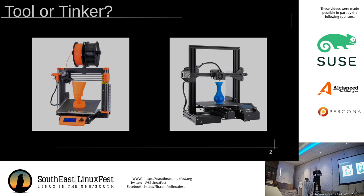At some point fairly recently, PETG came on the scene, and it is kind of in between PLA and ABS. It's still easy to print like PLA, but it has higher temperature limits and doesn't have the fume problem that ABS has. The problem with PETG is that it's dual mode. If you print it with your cooling fan on, you'll get fantastic bridging performance — when you have filament going unsupported between two points — but you will have terrible layer adhesion. If you print with the fan off, you will have terrible bridging performance but fantastic layer adhesion. So it comes down to which feature you want.